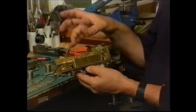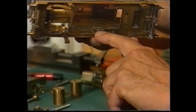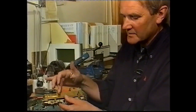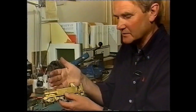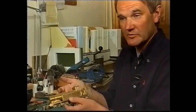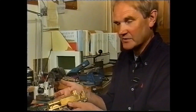Basically it's two sub-structures - if you look inside there's a cage at the front and a cage at the back, and it is literally clothed with the riveting detail. There are holes inside where you can just spot-solder to hold it; you don't need to flood it with solder. The one thing you never want to use is a blow lamp. They're designed to be put together with 145-degree melt solder, which flows very easily from a low-temperature iron, because etch kits do not like high temperature - that's when you get stretching, bubbling, and messy models.